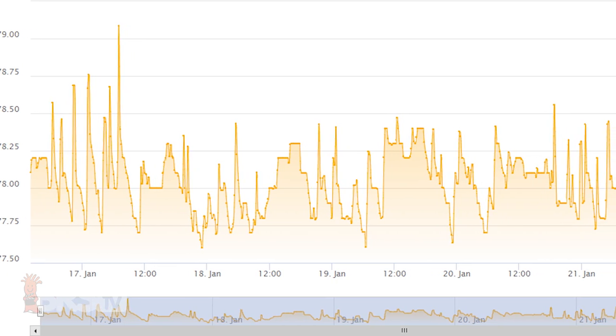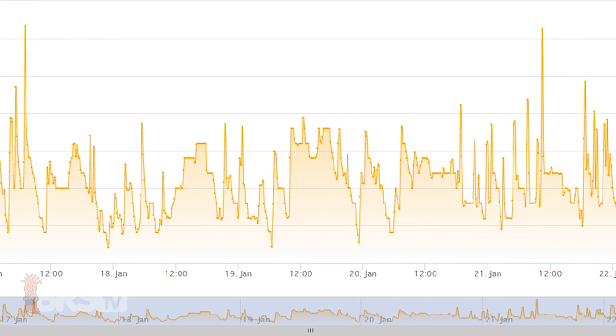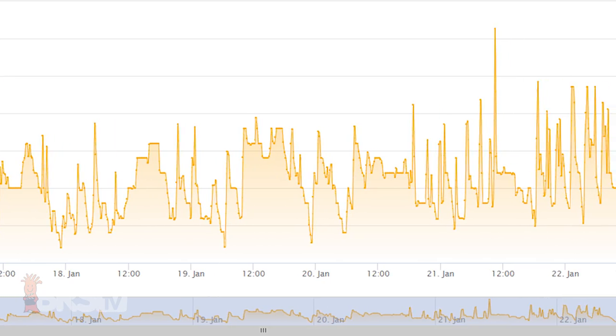And we also learned that we had set it at like 0.1 degrees or something, really tight swings, which makes it turn on, off, on, on. Don't do that anymore. I give it like a half a degree swing or so. Maybe even a degree. I don't know, it's reasonable.